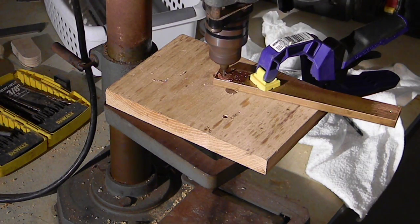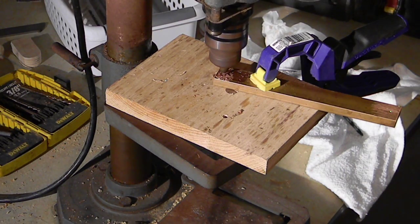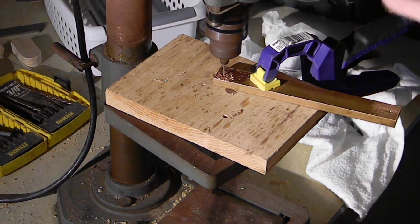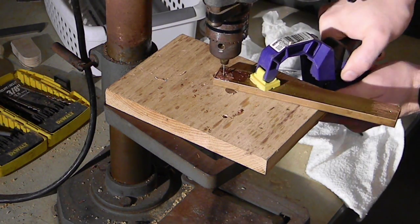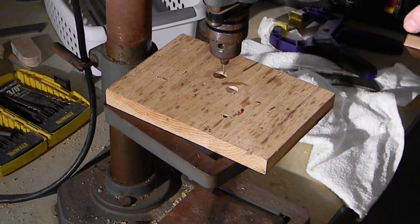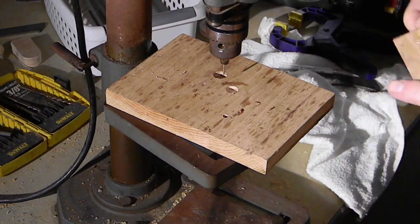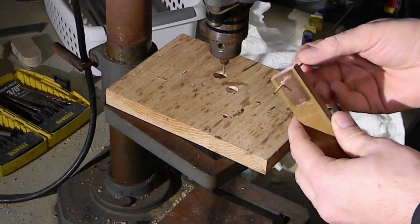But it's quite small. So I use a slightly larger drill to drill a spot hole first. You notice that it was very short. Well, it makes it a lot easier to keep those drills from walking if it's very short and if it's a little bit more sturdy, a little bit wider, larger diameter. So we're getting set up here to make some bolsters. They are going to be made out of copper.